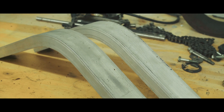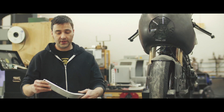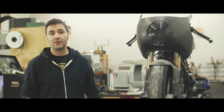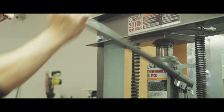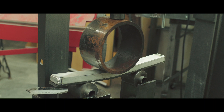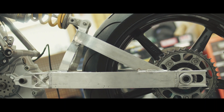The thing I'm going to be showing you today is how to take a piece of hollow aluminum tube and get a really nice gradual and structural bend so that you can use it in your fabrication projects. I'm not going to be using a mandrel bender or any other kind of complicated bender — just a 20-ton shop press from Harbor Freight and simple things like pieces of steel and bismuth alloy. I'm going to detail the whole process for you.